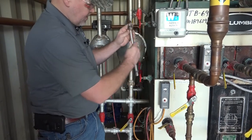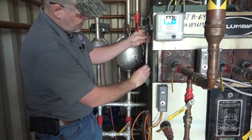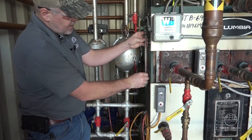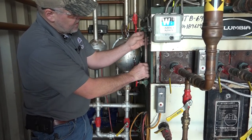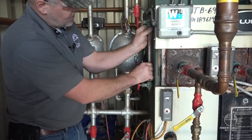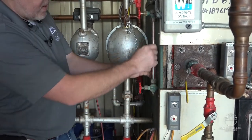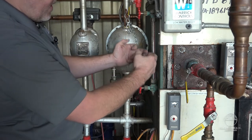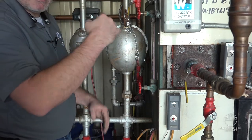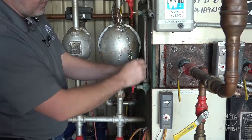At that point, run your gauge glass up to one of the stops, get it lined up, drop it down into the other half, split the difference between the two, and run your gaskets up there. Before you snug it up, make sure this red line — this particular manufacturer's gauge glass is called red line — the red and white help you contrast that water line, so orient it in the best direction for you to get that quick visual of your gauge glass.